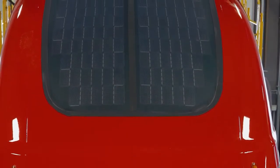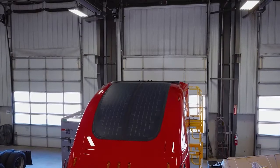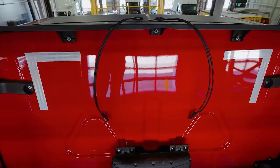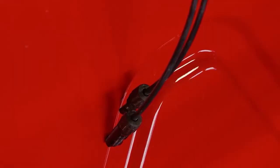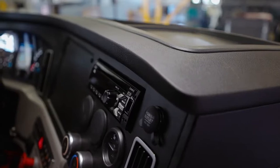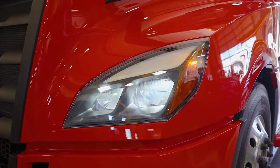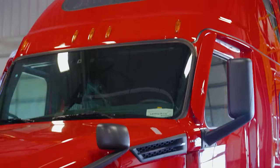The solar modules provide energy — they convert sunlight directly into electricity. They provide power through a charge controller that serves two functions: one, to protect the batteries against overcharging, and two, to maximize the power output of the solar for the charging going into the battery system.